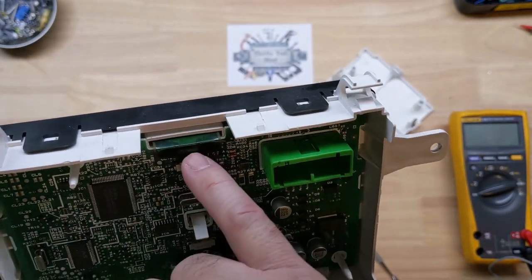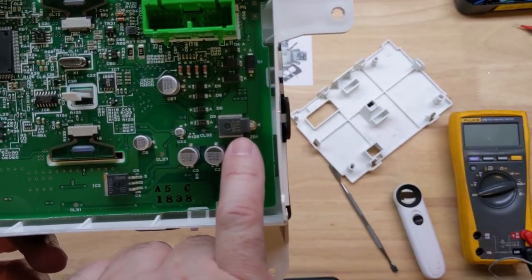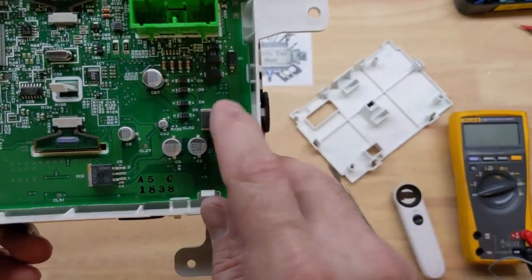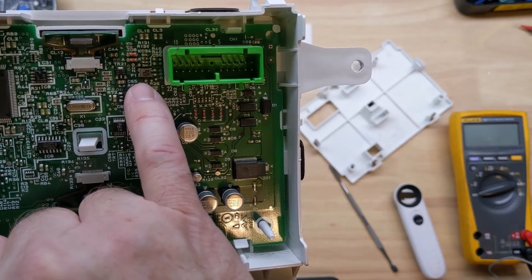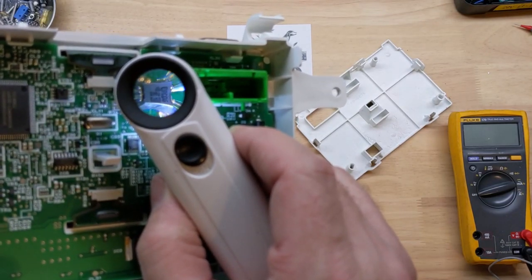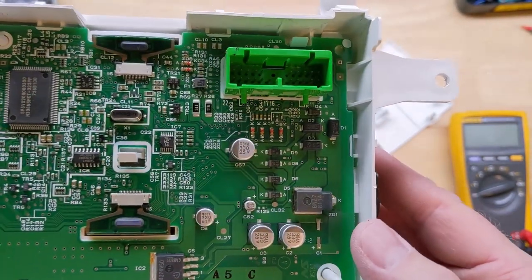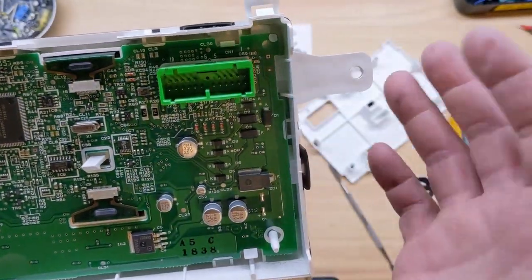A little chip on flex here. A couple of unique things here, even though this is a 2009 vehicle. There's an absolutely humongous zener diode — a BN27 — with our cathode and anode there. ZD1 it looks like. We also have a kind of an odd fuse made by Epcos. Unfortunately, I see no trimmer pots or anything that I was hoping might be a factory adjustment we could change intensity on, and I don't see any corrosion on any pins that might cause a signal to get weak.